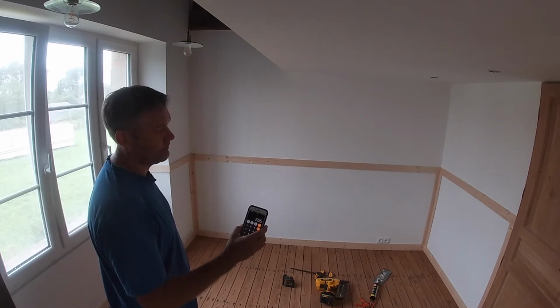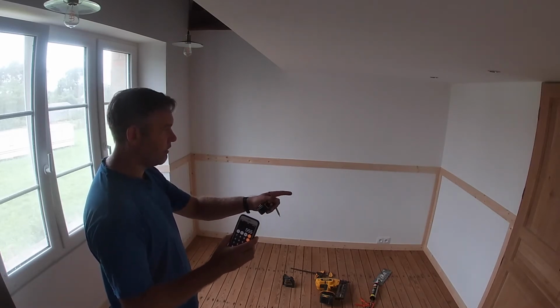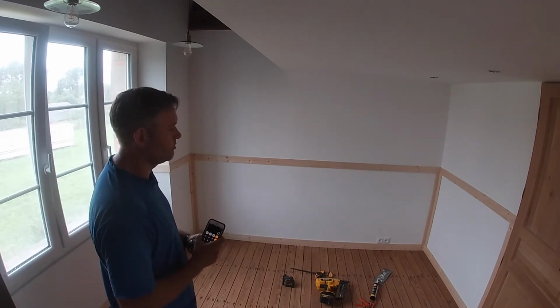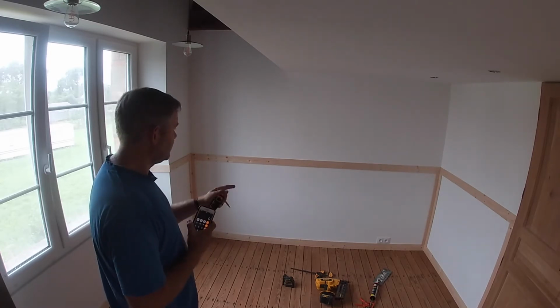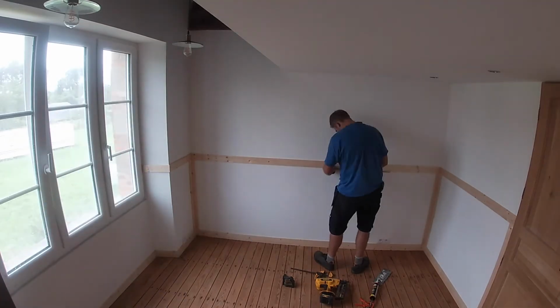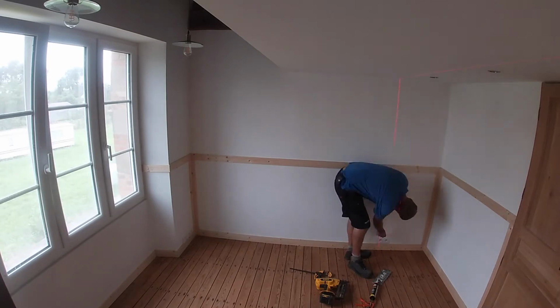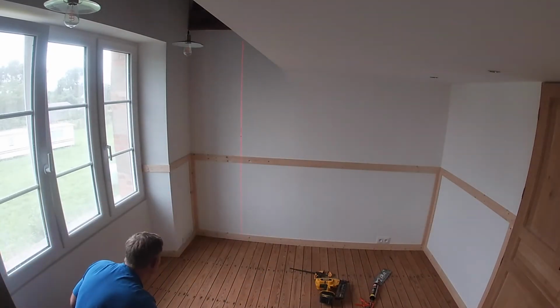size and even. And then you do the same on that wall, and you have a range that you want it to be in, so it's close to 60 centimetres or 600 millimetres. If we do 555 for each one of those panels, they'll all be the same size and they'll all be even. So what I'll do is I'll just draw on the wall now the centre of each of the uprights at 555, and you can see what I mean.